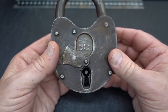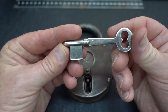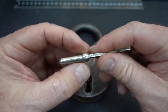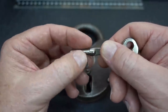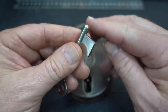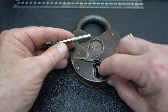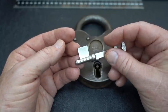So I'm trying to figure out how to open it. I got to digging through my blank keys, and I was in an antique shop in Elton, Virginia, where I bought a railroad lock, but I also bought a few of these keys. I don't know why I bought them until today. This is about the right length if you line it up — a very huge key. It's a steel shaft, and on the end it's a pot metal tip where all the bitting goes. This is a blank, all pot metal, so pretty soft but embedded on that steel shaft. What I'm thinking is I can grind this off, align it with the drill press, and then drill down inside of this shaft. It's pretty beefy here, and I think I can drill it large enough to fit on the stud on this pipe lock. Then we will have a tensioner. So that's step one — let me try to do that, and hopefully you'll see more of this video.